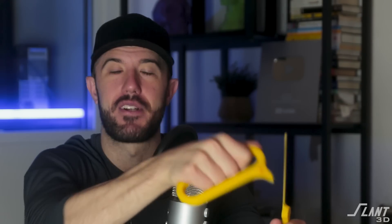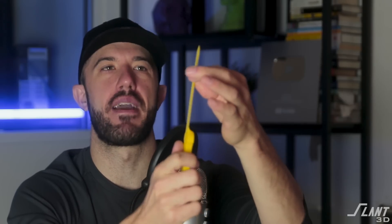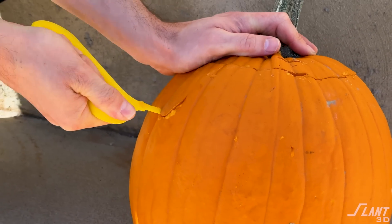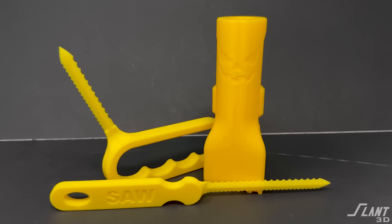The blade design uses a hemisphere on the side so there's a sharp flat edge against the bed, curving up from there. We'd actually make it a bit squarer next time, because the hemisphere makes it want to ride in a circle and you end up fighting the blade. These knives aren't that great for carving pumpkins yet, but the iteration process is the point — if you got user feedback saying the handle doesn't fit well, you just bulge up the handle, upload a new design, and every product going forward has the upgrade.